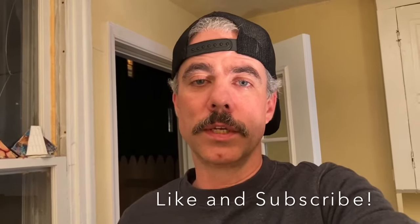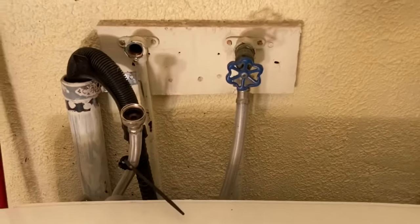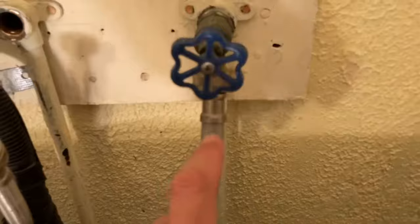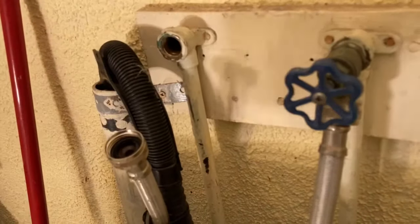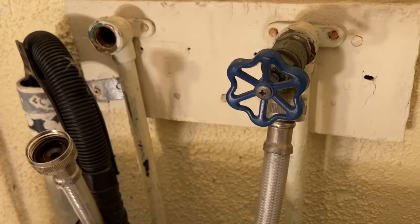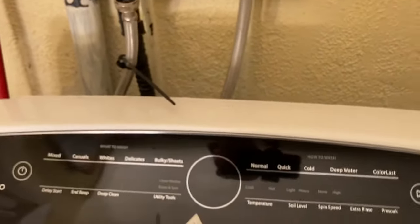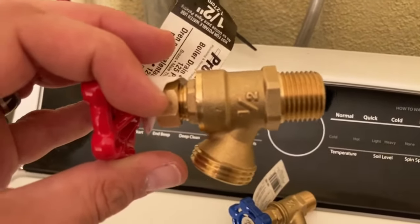Alright, let's get started. If you look behind my washer, that's where I noticed water was starting to accumulate. I looked at both the valves and noticed water was starting to drip out. I already took one off, so I can show you how to put the new one on. Now what I'm going to do is install two brand new ones. I'll show you how to wrap these in plumber's tape, because there is a specific way — if you don't do it that way, it will not work. Then we'll test it out.